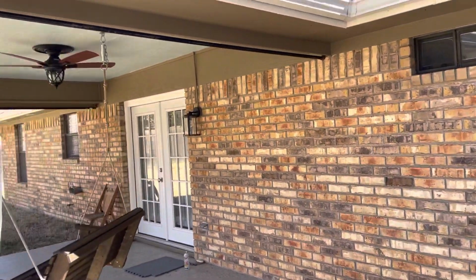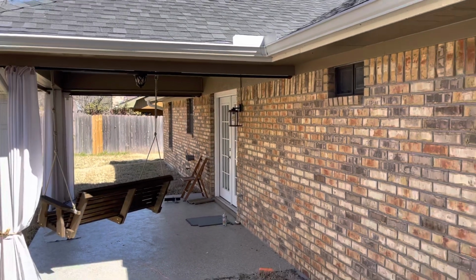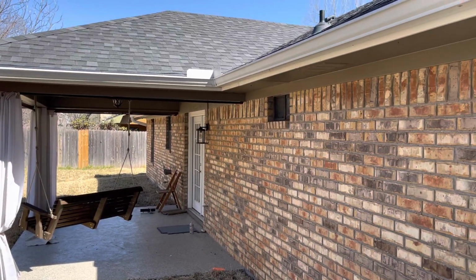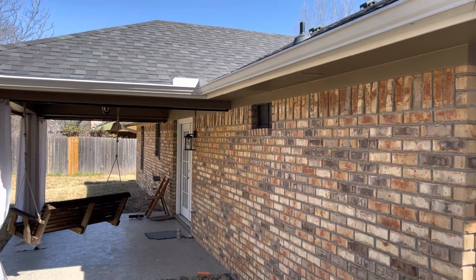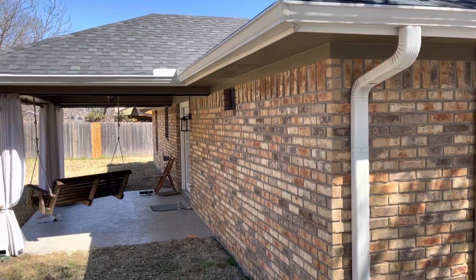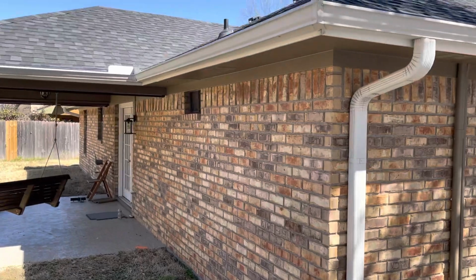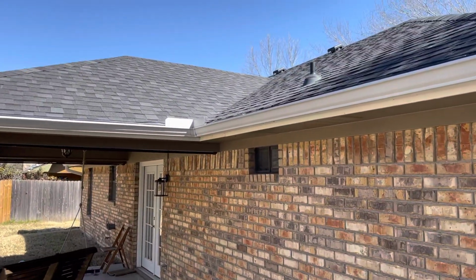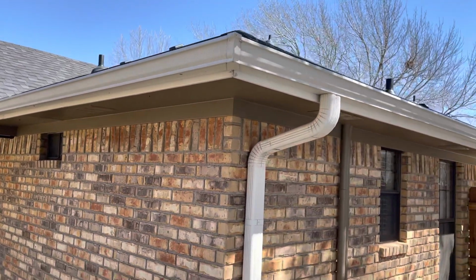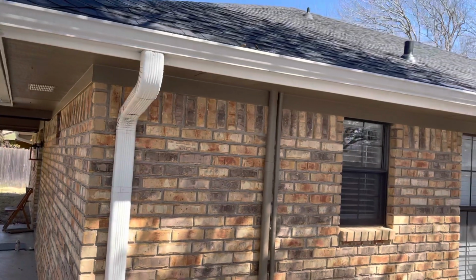I cut out the sheetrock above the panel only, so like a little 16-inch section and about 2 feet long. I drilled a hole up into the ceiling, and I think I used a 1.5 inch drill bit, maybe 1.25 inches. And then I shoved that bundle of wires up in the attic and grabbed a hold of it. And then I went about half the distance of the house, probably about where the porch comes out right there, up in the attic. Bought a 12 by 12 plastic enclosure, and then I bought some big lugs to wire splice, some 1/0 wire.